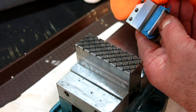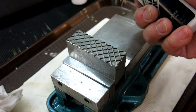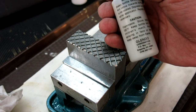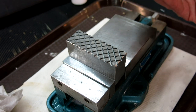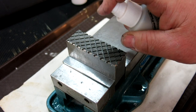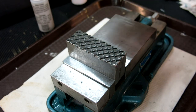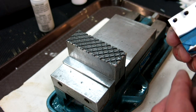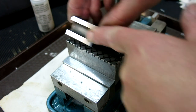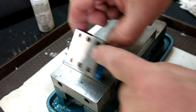This is a three-micron diamond from Acufinish — the Glendo Corporation there in Kansas. This is a spray, a suspension in an alcohol or solvent carrier. The little spray nozzles always seem to die on these things. You can dispense with all the screwing around if you just go straight to diamond — it's a much more efficient abrasive than pretty much everything else. I'm just going to do a few strokes here, flip it over, so I'm using both sides of the lap.